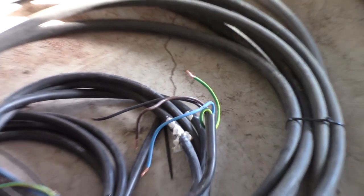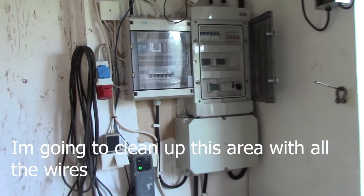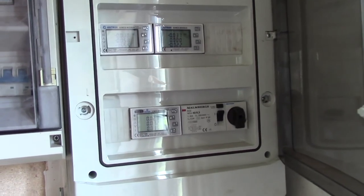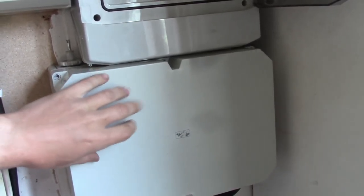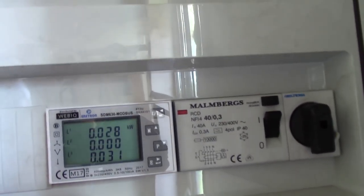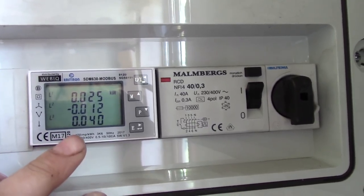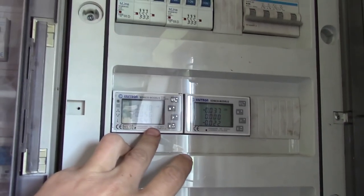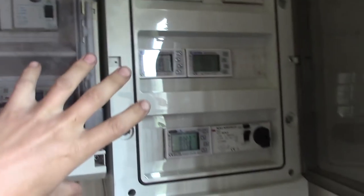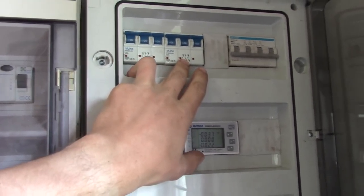That change is to make sure that I can run it all through my inverter. If you remember one of my earlier videos, I did not have the right side boxes. I have not marked them up yet, but my mains is now coming into this box here from the grid, and here you have the connection for the main grid connection. If you look at the meter, you can see I'm drawing around 30–60 watts from the grid, and that's because my system is not up and running controlling it. Those two meters go to my both normal houses, and in this box here we have the meter for the garage — so now everything is metered.